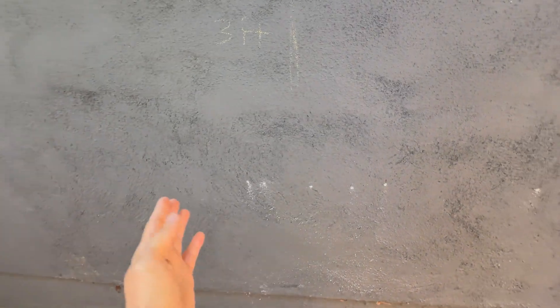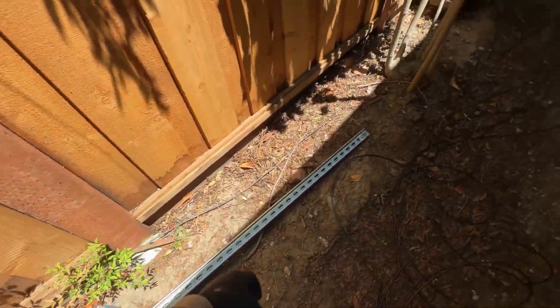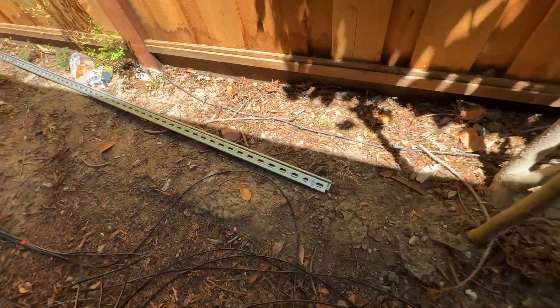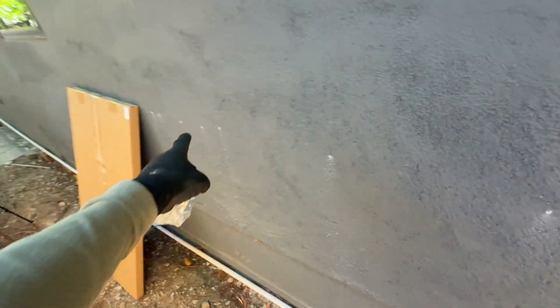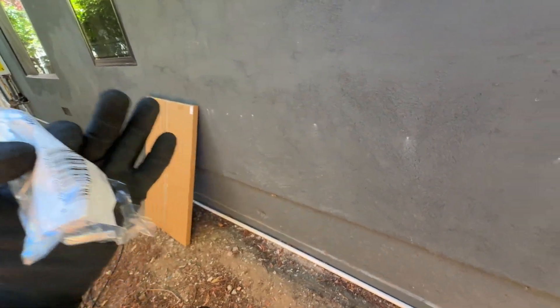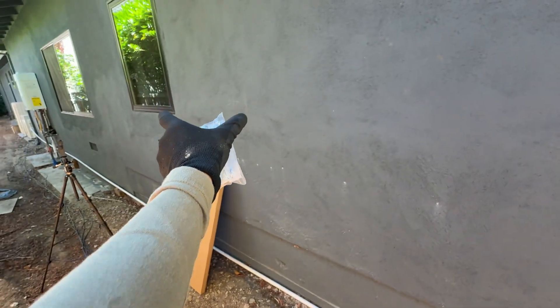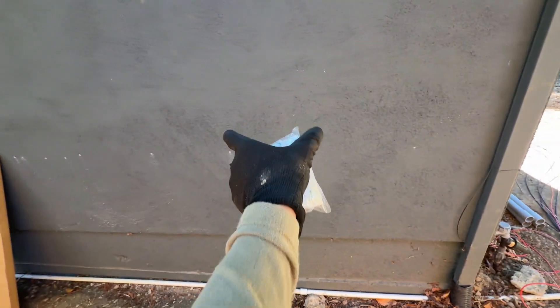I'm going to show you what to do in situations like that. To mount the Powerwalls I'm going to use Unistrut — a smaller, thinner one. I marked all the stud locations starting from here, every 16 inches. I'll mount two Unistruts, and using spring nuts we mount the Powerwall bracket. This way we can slide the Powerwalls to get exactly 36 inches between the window and between the two units.